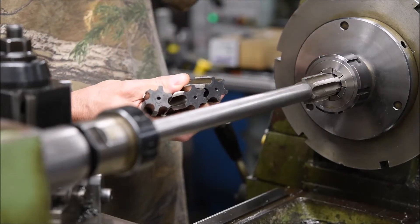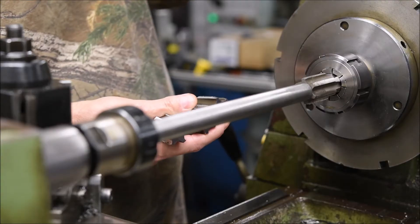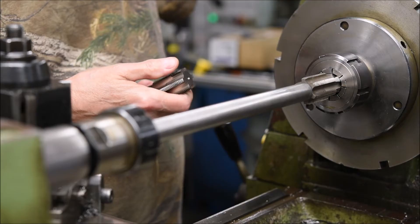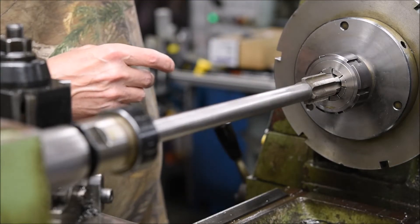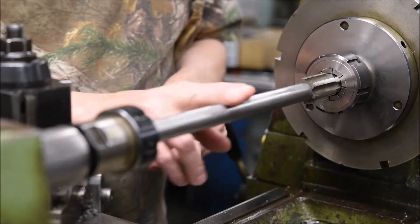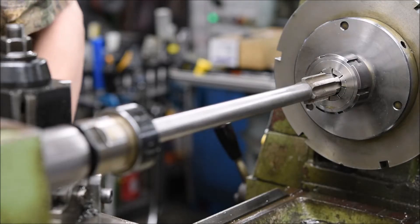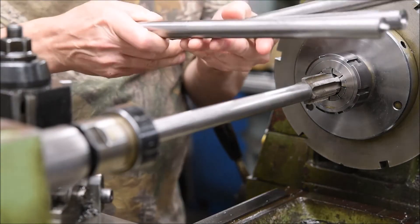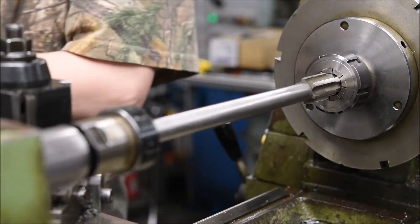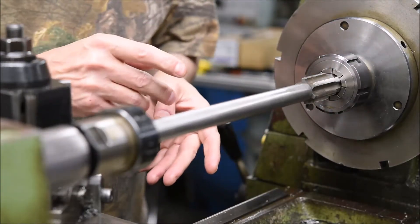The downside is you have to buy all the taps and they're about $200 a piece. I had mine ground by Regal Victor Machine in the United States. Once you're set up, you get a mandrel that fits your action body closely. I've got dozens of these mandrels that are all different sizes — I turn them as I need them and then put them back into inventory and use them as they come up.